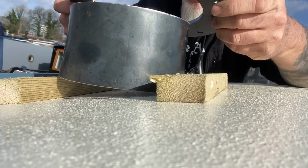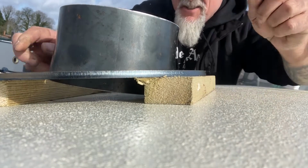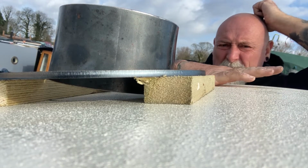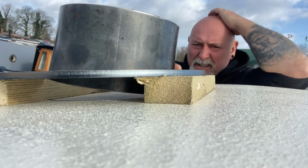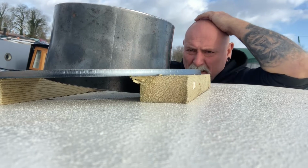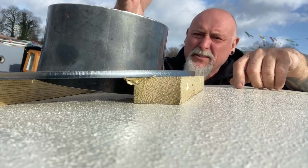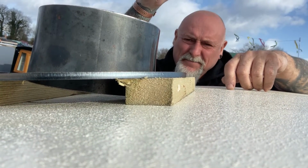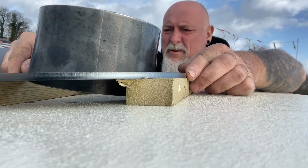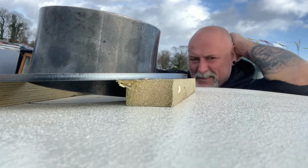Right, so this deck flange goes over there, and if I space it like so, then hopefully you can see the deck flange is parallel to the roof, but the extended part where the flue will come through the middle is now vertical, I should say, the top's horizontal, so the chimney will sit up vertically. So basically the idea is when you've got it positioned at this point, you tack weld it. That might be a bit awkward.